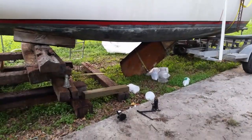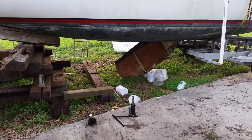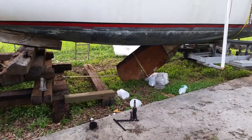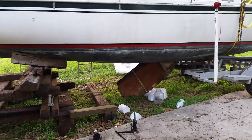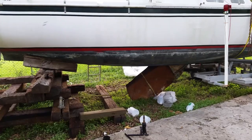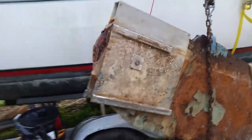We beat on it with a sledgehammer and got it to pop down — the back of it's out but the front is not. We'll figure out how to get the front out. Go ahead, real slow. Keep going. Real slow, Will. A little bit. Stop. This is the keel — you can see the hinge point on the keel and all the rust has got it stuck in place. I'm lifting the keel up on my hoist to get it in the back of my truck.